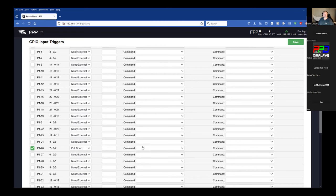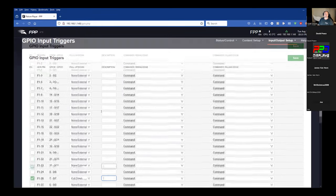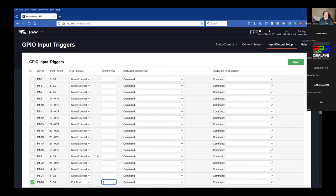It has an external pull-down, but you can change it to pull-down in the settings for good measure. Scroll up and there's a description. You can name it — 'Red Button,' 'Blue Button,' 'Green Button' — so you know which button is hooked up where. Rising edge is when the button is pressed, raising the logic level via the board's level shifters to 3.3V safe for the Pi. Falling edge is when you release the button. Typically you'll trigger on the rising edge, though you could have pressing do one thing and releasing do another.